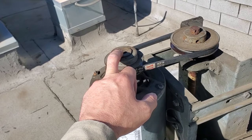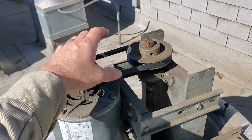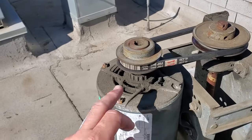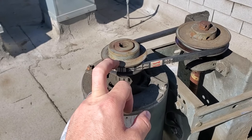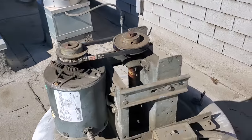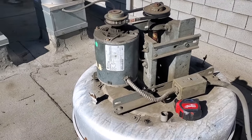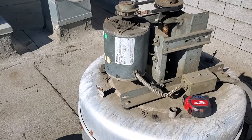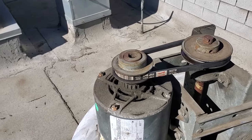I'm going to recommend a new motor pulley and a new drive pulley. We're going to have to probably go up in belt size because I'm probably going to speed up this exhaust fan, being that we're under-amping on this motor and looking at all the rust on the ceiling. When I do that, I may change the airflow to the building and may have to adjust their makeup air, but we'll address that as the time comes. For now, I'm just going to try to get this thing up and running and pulling the steam out of the dish area a little bit better.